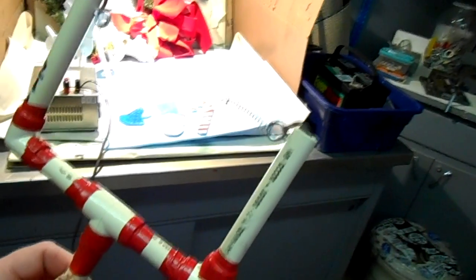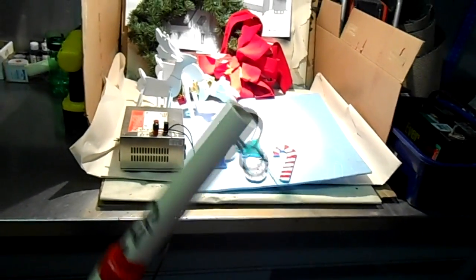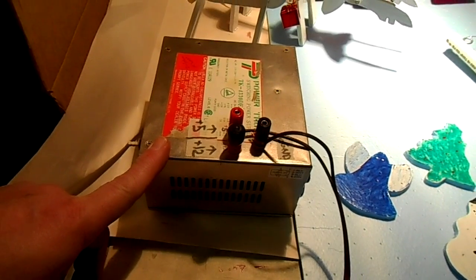This hot wire device consists of a handle and a piece of wire that is nichrome in nature. I've heard that guitar strings work just fine too, like the E and B strings. The handle connects to two eye bolts, and DC voltage is passed through the nichrome wire to cut the foam. It's a pretty simple idea. The power supply we're using is five volts - it's an old computer power supply.